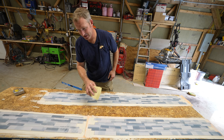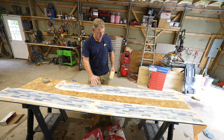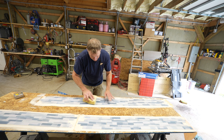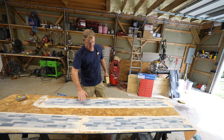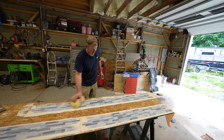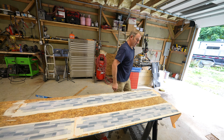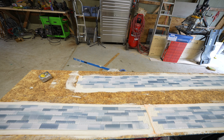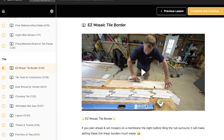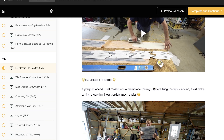This being set up will make the installation a lot, lot easier. I'll be able to line that straight up with the tile. I'll be using some shims to kind of hold it in place, and you're not going to have to struggle trying to get this aligned because I can build up as much as I want behind there. Taking the extra time the night before to do this is really well worth the effort. This is going to make life so much easier when you go to set this into your tub surround or shower.